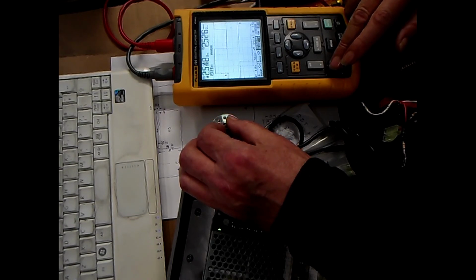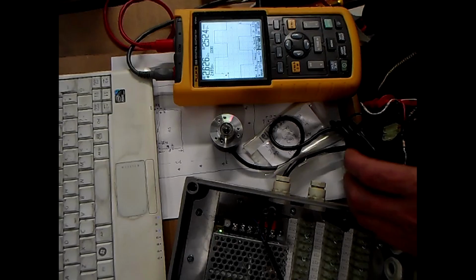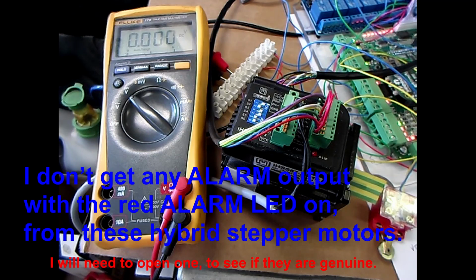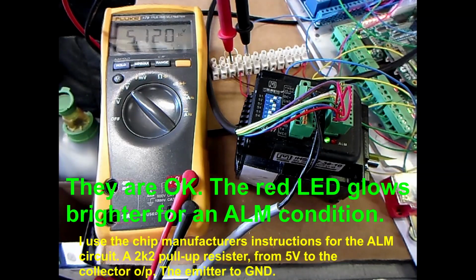The regular G-code program, as interpreted by the router, is as follows. First line, a percentage sign, which means start of program. At this stage, the spindle is turned on, because that's the default. The L-box gets power for now. Second line, G17, select XY as working plane. Next line, G90, absolute position information. Next line, G71, dimensions in millimeters.